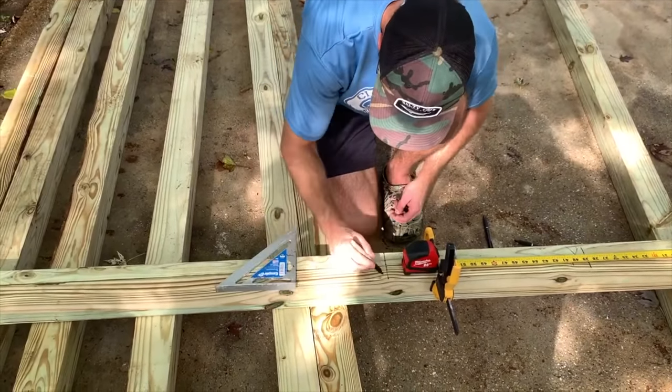You might also find it helpful to actually secure the vertical piece of J trim at the top, at least temporarily, while you install your panels. Now, although I installed the standard J trim in the corner, I installed something called H trim on the right hand side because I'm gonna connect another segment of ProSlat slat wall to the other side. This H trim will allow you to keep a continuous run that's longer than 8 feet in length.